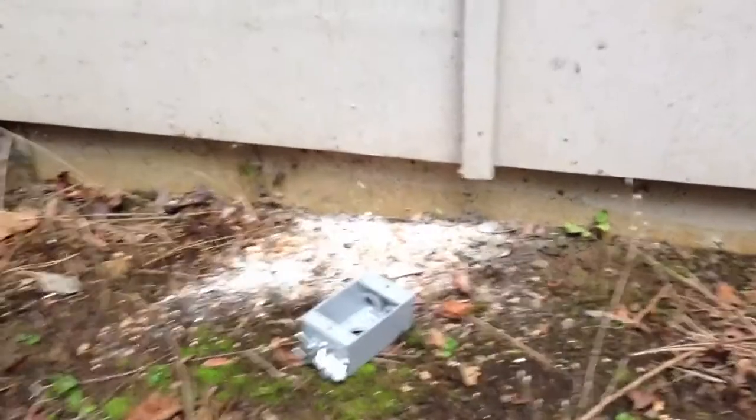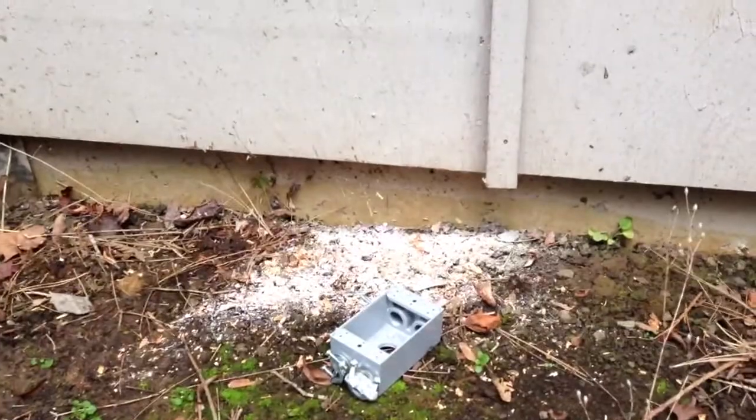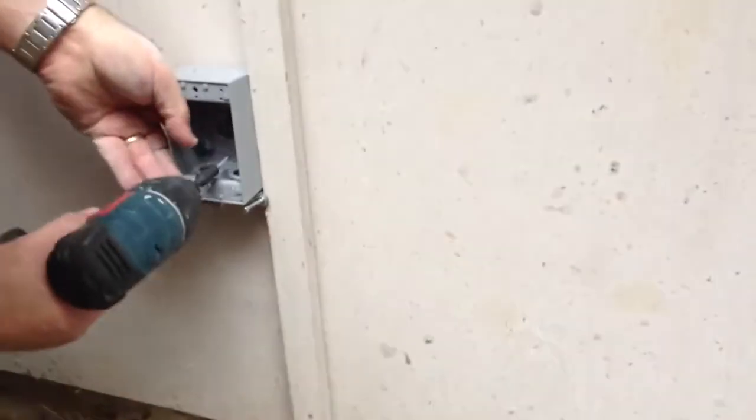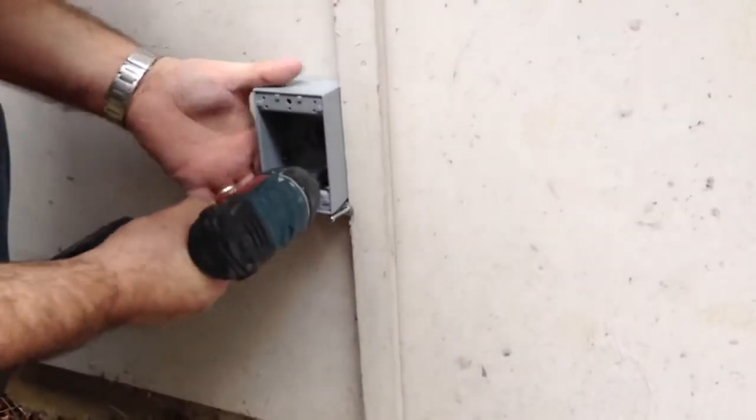So now we're outside. We've cut our hole here in the building — this goes straight into that middle box — and we've cut two secondary holes on the outside for our new boxes. We're going to run a cable, a conduit and wire all in one. I'm putting in a junction box on the outside; it's a little bit easier for me to hook up the wires here and run one each way.